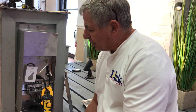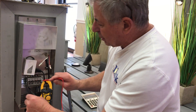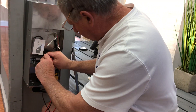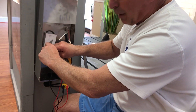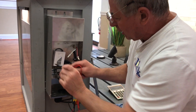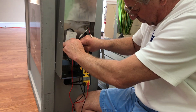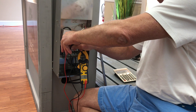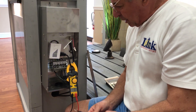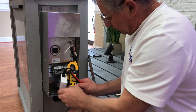For example, put your probes in — red to red, black to black — and then it doesn't matter, you can switch them around. Let me put my glasses down so I can see what I'm doing. Remember I said it was a factor of 10. We're on the common — touch one probe to the common, one to the 12. I'll switch colors here — remember it's AC current so it won't matter. We're getting a reading of 10.2. Can you see that, Brian? And you're going wait a minute — he said 120 in, 12 out. Why are we getting such a low reading?